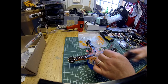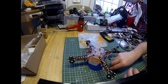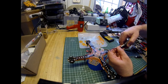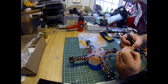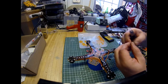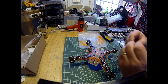Cutters. And we'll just part that wire. It might be kind of hard. Might need my knife or my cutters again. And just carefully in the middle of those two wires, give it a little cut. We're going to strip that anyway. Just so you can pull those apart a little bit like that on either end. There, and just use your fingertips.